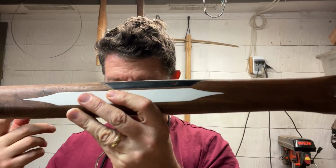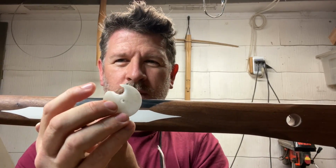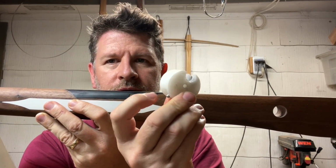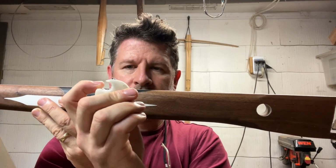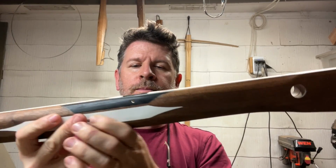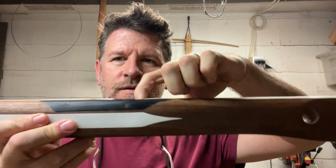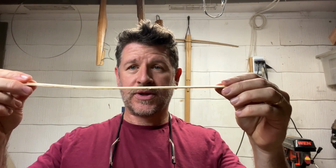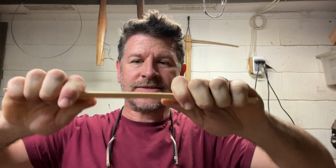Well, the nut, because it's round, transfers that weight pulling there into rotational energy, and the trigger fits into that slot and pushes there. So essentially that 1,000 pounds is getting transferred from there and is now pushing on the end of the trigger, which is inside. So what that's doing, it's creating pressure against the axle of the trigger here and the front of the socket here. So it's essentially pulling those two things apart. So wood has pretty good tensile strength. So without bending it, if I just pull straight across, it's very hard. It's not going to break.